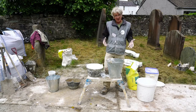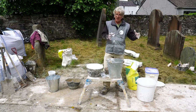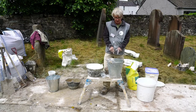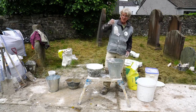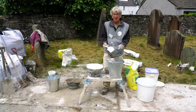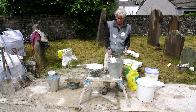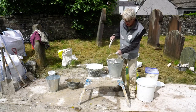Most of any real lumps are going to sink to the bottom, but the other way of dealing with it, and this was the way they dealt with lime putty as well, rather than laying it down in a pit for those lumps to be slaked away over time, would be to dilute it down to a lime wash consistency. Doesn't drip, nicer colour actually, but you can see the little tiny bits of unslaked lime. So you would do that and then pour it straight through a sieve to extract those lumps and then apply it. That's the method there, and that one is a perfectly acceptable thickness.